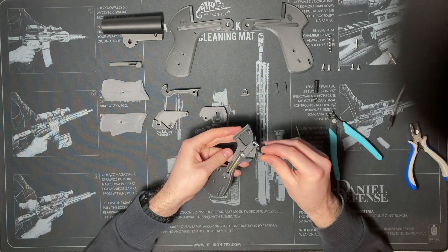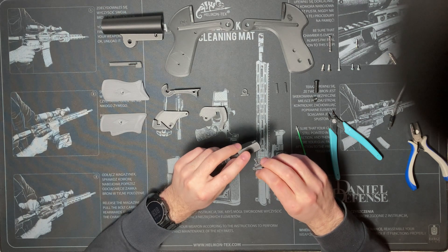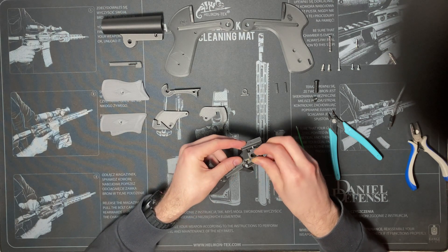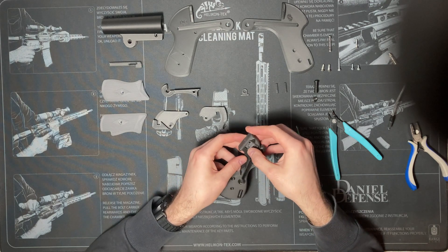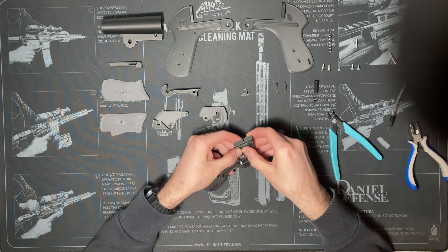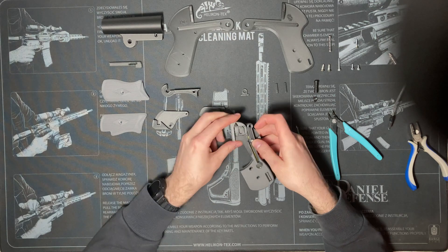Take your pin and press it into the small hole of the printed part. Put the firing pin assembly into its designated slot in the frame, with the metal part going through the small hole of the breech face. Make sure it slides freely without binding.